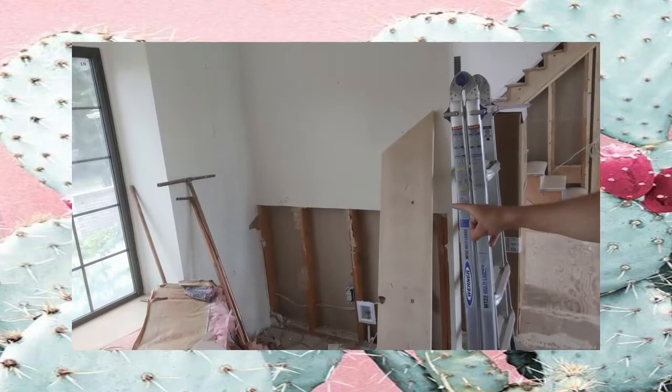The last thing is the bathroom right above the kitchen. Where the fridge is going to go, there's a little half wall, and they're going to put a supply that goes up into the attic and then down into the bathroom through the ceiling. They can't run it normally through the walls because we have a steel beam here and a steel beam there, and the bathroom is right in between those two beams. That locks it in, and they can't bring it along the outside wall either because that's where the bathtub is.